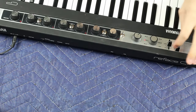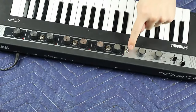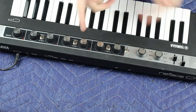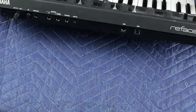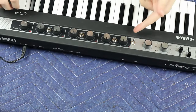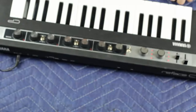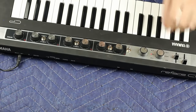There are plenty of ways to do mods like this to access the grand piano sound more conveniently, and you don't have to put your switch where I did. I've seen a lot of people put the switch on the left side on the black plastic — wherever you can find room. I just thought it looked nice where I put it because it lines up with the rest of the switches and uses the same form factor. Put the switch wherever you can fit, as long as you have enough wire to reach. And again, if you don't care about the toy piano sound at all, you don't even have to bother putting in a switch — you can just de-solder the connection to the toy piano sound and put it back together.